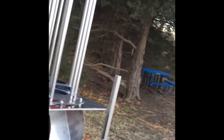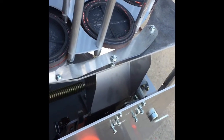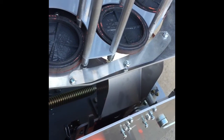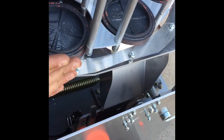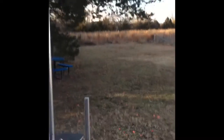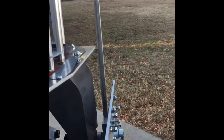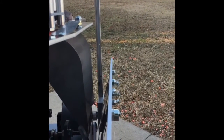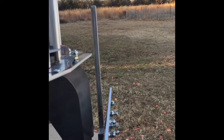If you're seeing it feeding and everything's looking good, you also want to make sure what your rabbit target is doing. If you notice it's breaking targets on the fire, or it's just coming off without a lot of spin and momentum, you probably need to adjust your throwing arm on that block either a little bit more in or out. Right now we've got a nice south wind blowing pretty hard — we're coming out straight but then the wind takes it and pushes it off to the right.